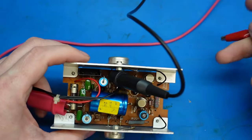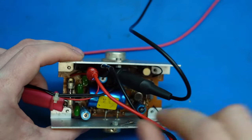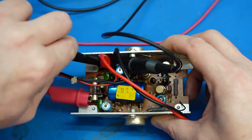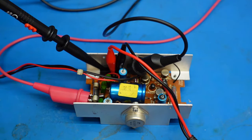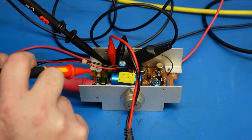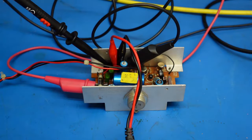Now we need the signal. There's a ground on this pin here, and signal goes in there. And finally the output - we'll use the oscilloscope probe on there. That's where the output goes. Let's see what she does. Just checking for any DC offset voltage that might cause fuses to pop. We have it - 22.8 volts. That's massive, although this is capacitively coupled at both ends.